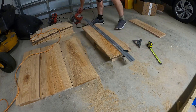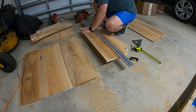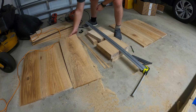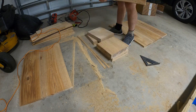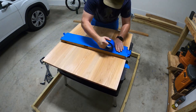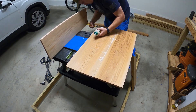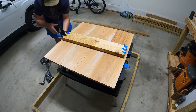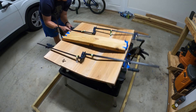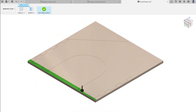I used a straight edge to trim just enough off the side to give me a straight flat edge to joint with the other boards — this would have been faster and more precise with a joiner or table saw but I worked with what I had on hand. Gluing three of the panels together gave me roughly 33 inches square of stock. I am using Titebond III Ultimate Exterior Glue. When gluing the panels together I had to make sure there was a flat supporting surface clamped down, otherwise the boards have the tendency to explode. I quickly realized I needed more and larger clamps for this job.